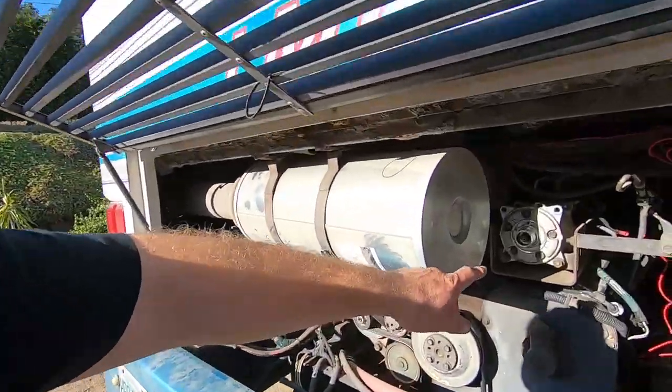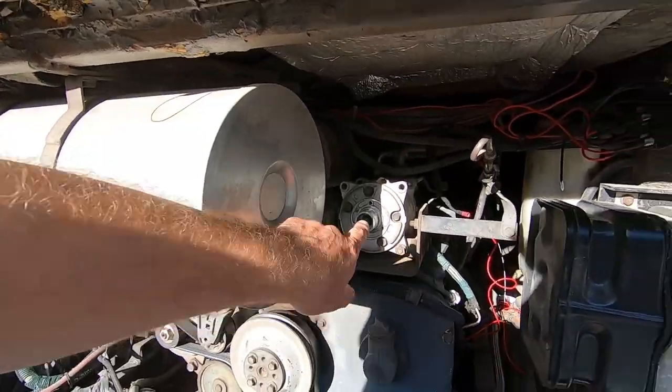The main issue is the air conditioner stopped working — it was a blown fuse for the AC clutch. We've got the AC clutch off, looking for just a clutch, but no listing on that compressor from O'Reilly's for just the clutch. I ended up having to buy a whole compressor just to take the clutch off and put it on ours. With the giant windshield of the RV, we definitely need air conditioning, especially for the dogs.